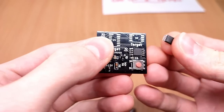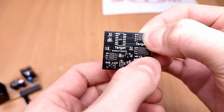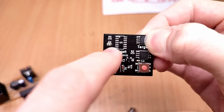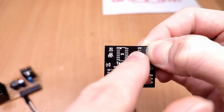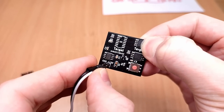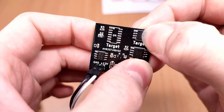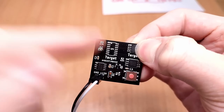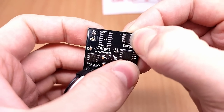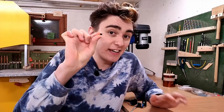This works for most 8 and 14-pin chips of the ATtiny series. I merged the two schematics into one PCB — there's a voltage regulator to create a 5V supply for both chips, 12V fed directly to the reset of the bricked one, and an LED to do some flashing and tell us what's going on. The idea is I take the bricked chip, place it on its footprint in the right orientation, and click the button. If everything's alright, we should see a brief flash from the LED and that should be the fuses reset. And that is pretty much it — that brief flash is all it takes.